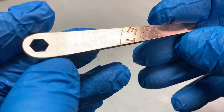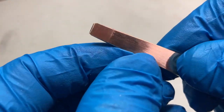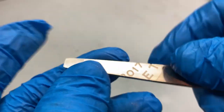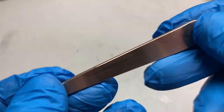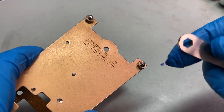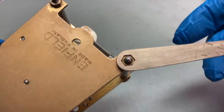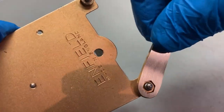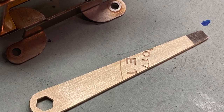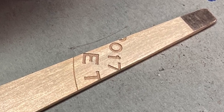This is what we made — it's a piece of 2mm thick brass with a screwdriver filed on one end and a quarter inch across flats hexagonal hole on the other end. This is a nice little tool to use and the beauty of it is it minimises marking to the clock plate or the brass nuts. You can see I used a bit of scrap brass from an old project, hence the engraving on some of these tools.